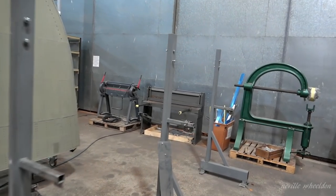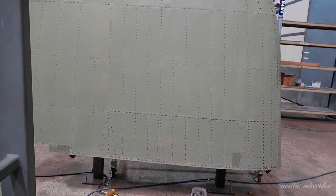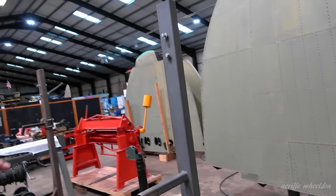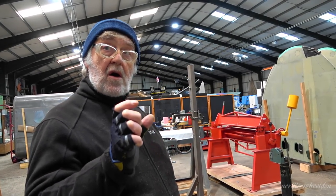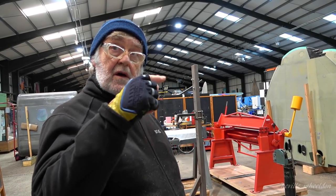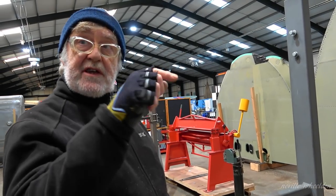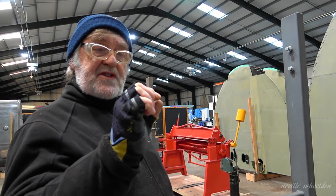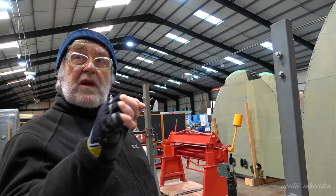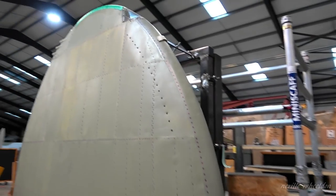There's the same on the other side — they're like little castings, the way it came. All the lenses done. Is this the new lens? No, I recovered the old one off of Jane's ones. Where the holes were all in the wrong places I cut holes out, opened them out, and then I got some acrylic bar, cut slices off it, and bonded them into the holes to repair them.